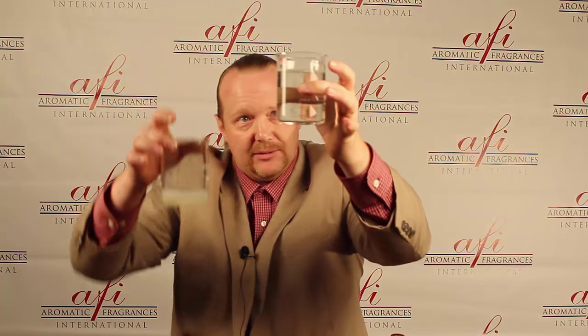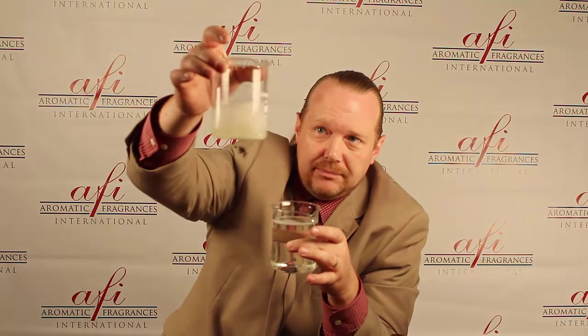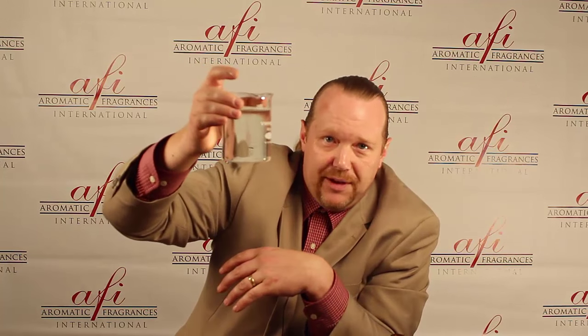This is the milky separation — that's just oil and water. This is the same amount of oil solubilized with the surfactant — clear. So if you're having this problem, most likely it's because you need a surfactant since you have too much water in the product. Let us know what application you're using. We keep about a dozen surfactants on hand in the warehouse, but there are about a thousand on the market, so we'll help you find the right one.